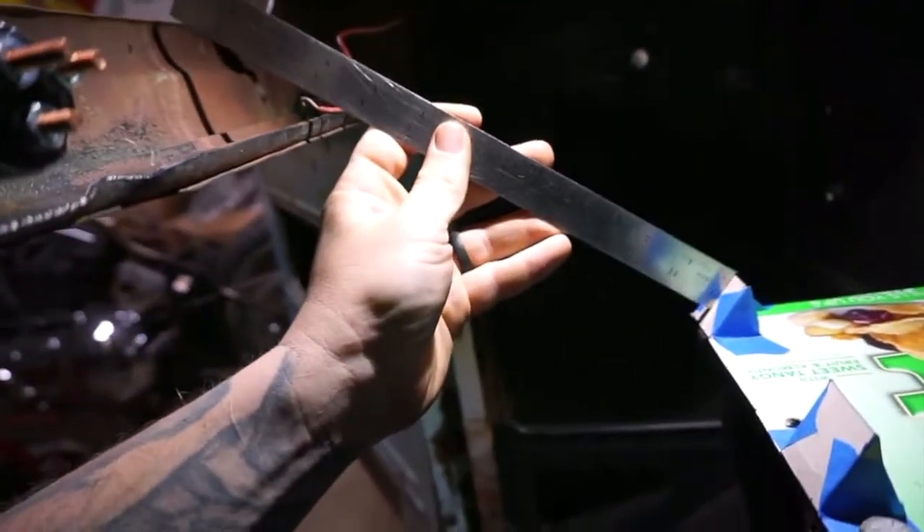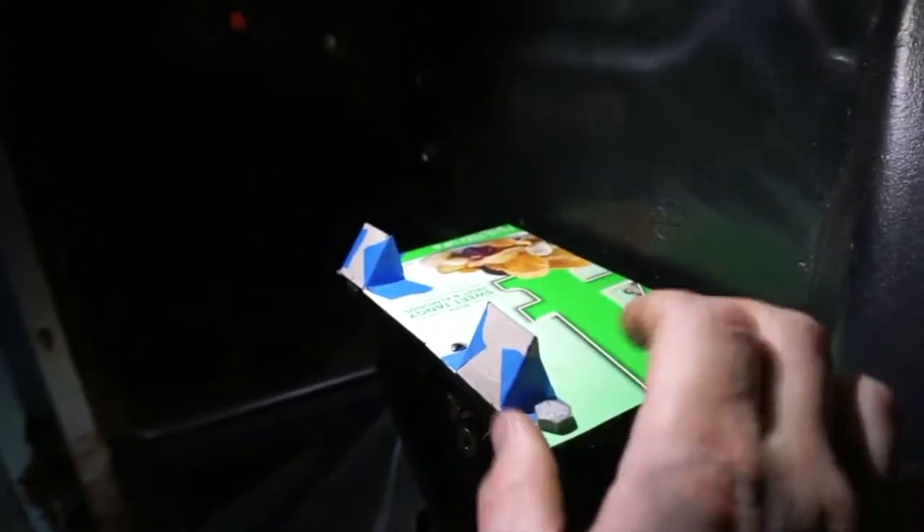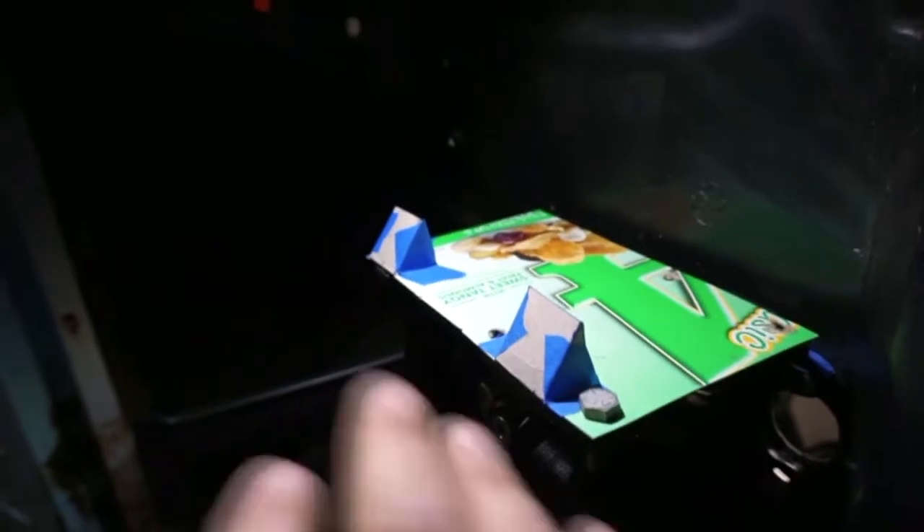Alright, so here we are. I cut those angles, I folded the things, I put them back so they're gusseted. They're tall, they're what they need to be. Here's the dash bar that we're going to support. And that's how the bars are going to run — now I just have to design the top piece where all that's going to go, so that way I can mount the steering wheel and support the brake pedals. And even if you were going to make this in SolidWorks, Mastercam, Fusion 360, or any of those programs, it really helps to make a paper template first so you can have all your dimensions and see that it fits. You may not know the exact measurement of this angle just in your computer, so it helps to have a mock-up even if you're doing it digitally. That way you know — 35 degrees, that's what I need to set those back to. I've been doing this for maybe 20 minutes, but it's totally worth it in the end.